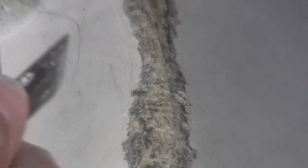See how nice a job I did on that — all that crap's gone. Here's another section. You want to get all those cracks out and put that fairing compound over it, and it won't crack out again with those micro balloons.